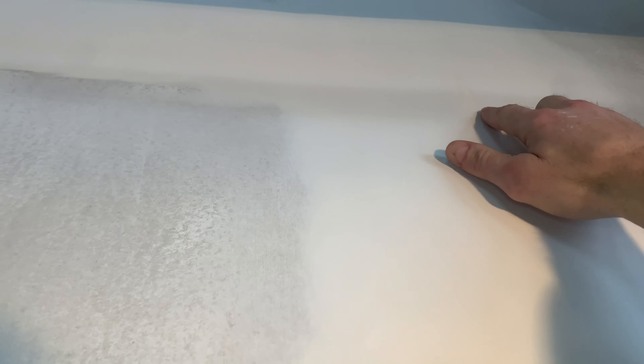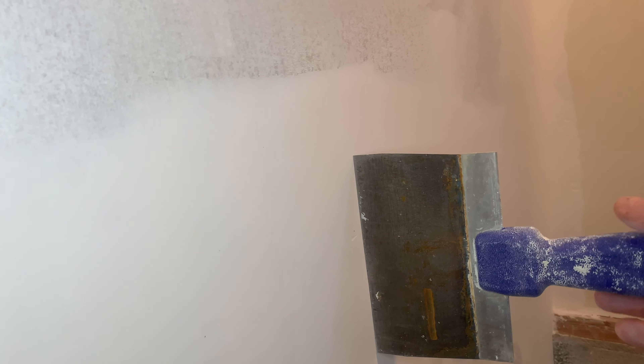There are a couple of potholes that will fill in and sand down. Overall it's about 80% done. There's another spot with a tape bubble to fill. It's sanded down but there are a couple of high spots I'll need to feather out. Near this seam I'll need to feather it out more as well. You can see with this knife there's a little bit of a hump — I need to feather out more and ease that transition.